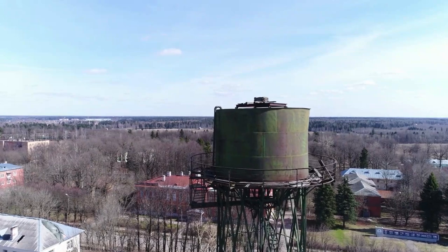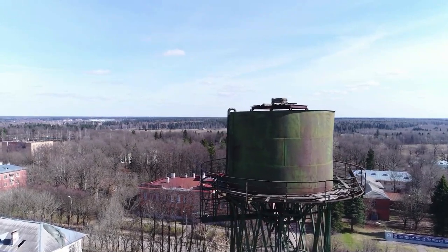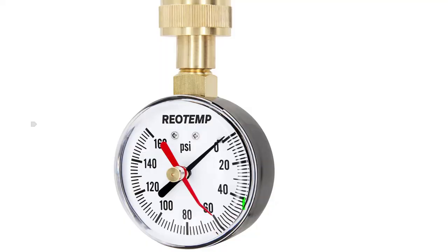What have these got to do with water towers? Well, pressure. The goal of my local utility that provides my water is to make sure everyone gets roughly the same amount of water pressure. So in my water service area, the water pressure has to be designed for a minimum of 40 pounds per square inch and a maximum of 80 pounds per square inch, or PSI.